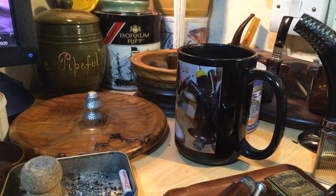Oh, the draft hole, okay. Well, for me, that's one of the advantages of using a lathe for the draft hole. Most of these companies drill them freehand, so they'll have a spinning bit and they just feed the pipe into it. So that's never going to be as pretty to look at as a drill done on a lathe. The drill done on a lathe should be spot on.